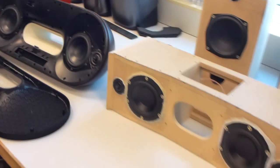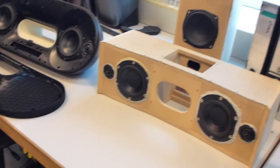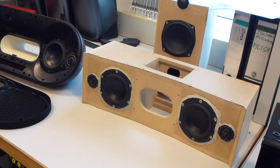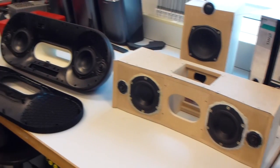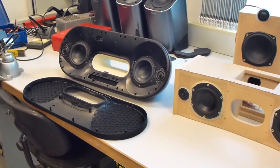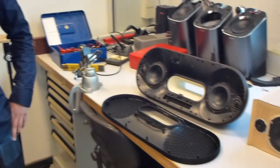Why are the speakers directed inward? For the woofer, it's more for the design purpose — there was a big discussion on this. For the tweeter, we absolutely don't want that. At high frequencies, which get more directional, you definitely don't want to point them inward. If you point them completely outward, they point to the side walls, you hear more energy from the side walls and it feels wider — less clean, but wider.